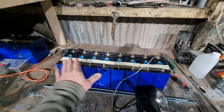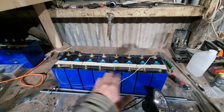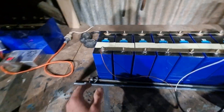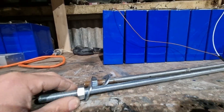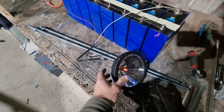I put a little halogen bulb on it and brought the voltage back down to about 3.4 volts. So now we've got the overcharge off the top of these cells — we've taken the top charge off and got them down to a stable level, but some of the cells have swelled up. I put a load on it and brought the voltage down.